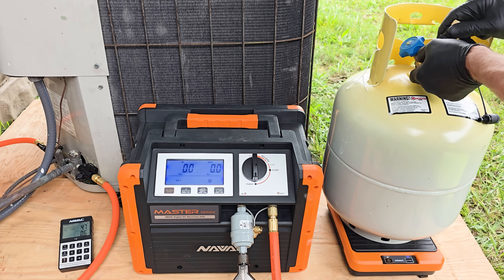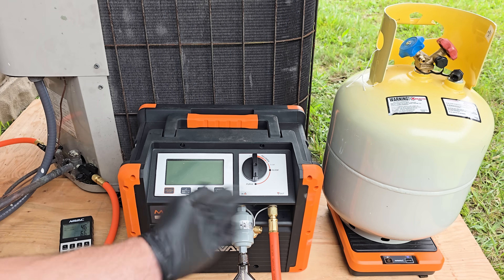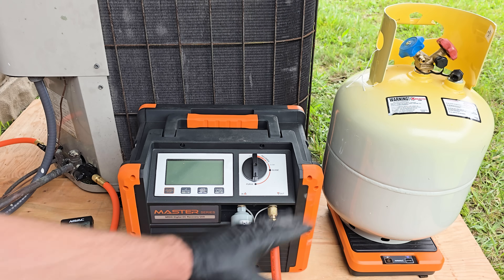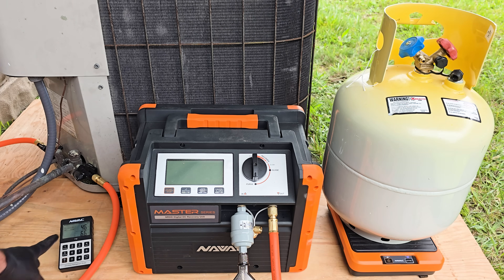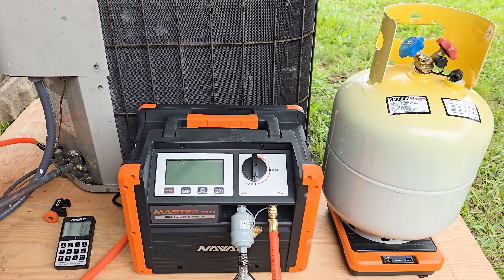It's important to note that some recovery machines may not be vacuum rated, but this one is — that's why we pulled a vacuum on the hose setup. You're also going to notice that we didn't recover over about five pounds of refrigerant from the system. The refrigerant weight did change once we added the hoses, but we still monitor it anyway — just to make sure we don't go over the maximum, because you never know if a system's overcharged when you're close to the max weight in the recovery tank. So we're just going to go ahead and disconnect here.